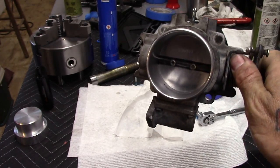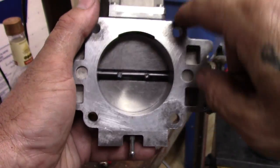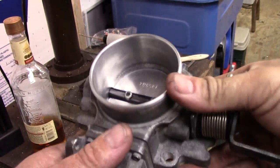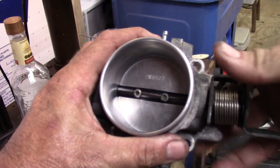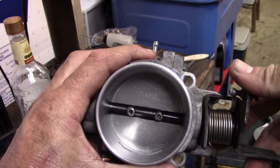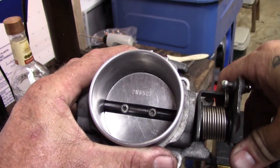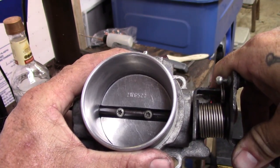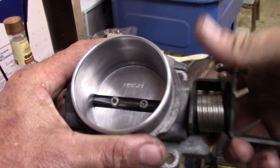All right. Next part of the video, be on the Jeep running. I lied again. I bratted the threads and used Loctite. So if those screws ever get loose, you would think, oh, it's going to swoop right in the engine. Well, sucking it in the engine would be not as bad as it's sticking. It'll start sticking. If you ever notice your throttle on any car with a carburetor, fuel injection, whatever, and it wants to keep sticking at idle, like half open a little bit, idling real high, you want to check that, because if that butterfly moves any at all, it will start sticking open just a little bit.